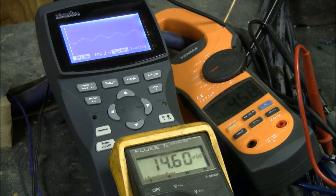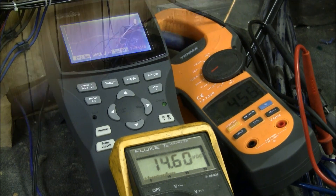You may have been able to tell it started to sound pretty bad as well, so that's one way you can tell — the way that it sounds. But that's a very quick way to destroy a speaker: clipping. It can be from a dirty amplifier, low voltage, a dirty signal, any number of things. If your gain is set too high for your RCA voltage, all of those can cause clipping, and that's what causes problems.